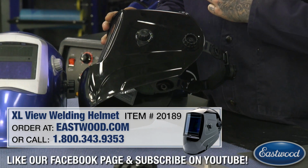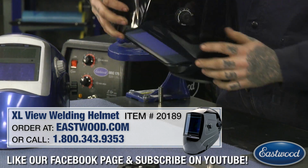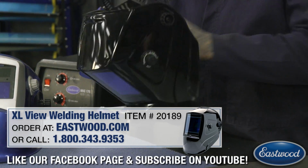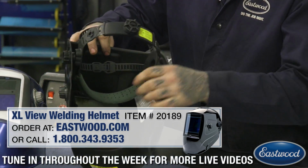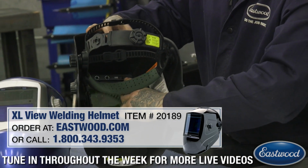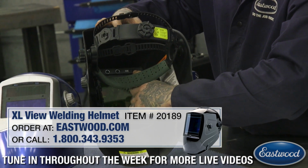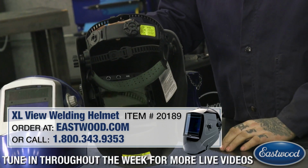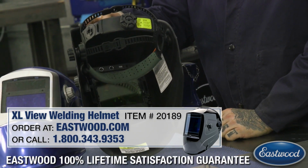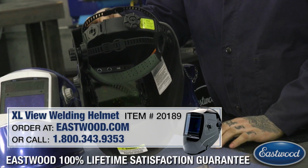So it goes from like a 4 to 13 shade too, it looks like. Yeah, I think on this particular one, to get between those, there's a setting here on the inside, which probably will be tough for you guys to see. We got a pretty good zoom, but it's probably hard to see that. But there's a little switch here where you can switch it between the two ranges. I usually keep mine on the lower range because a lot of stuff I do is lower amperage, and that covers most of the stuff.